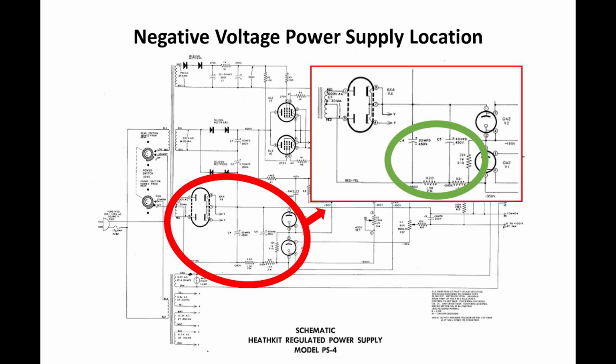The real problem in this circuit were the 3 resistors, R19, 20, and 21. R20, the resistor that sits between the 2 capacitors, C4 and C5, is supposed to be a 1.5K 2-watt resistor, and it actually measured at almost 3K. So it was off by almost 95%, which is crazy. And that's a current limiting resistor for charging up C5, so that would really affect the operation there.